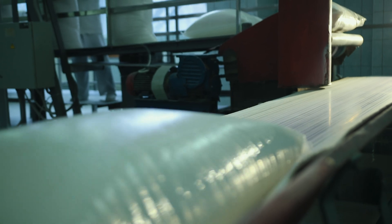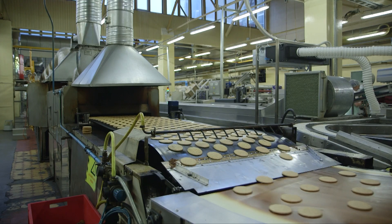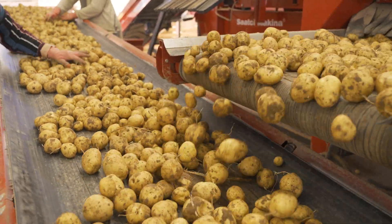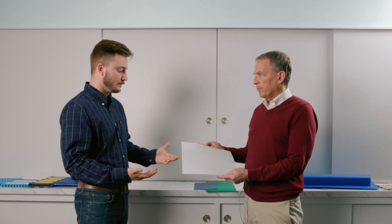These would be used in bakery industries. They're lightweight with a PVC covering woven on the back. PVC is great for scrapers too — if you have a product that sticks to the belt, you can use a scraper to scrape it off. They're less easy to clean because there is a pattern to the belt, so if you need to wash it down, it does get a little more difficult. But it still can be cleaned. The PVC covering on top would also affect its heat resistance and its ability to operate in high temperature areas.